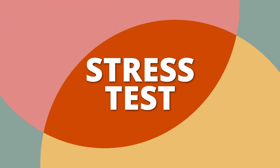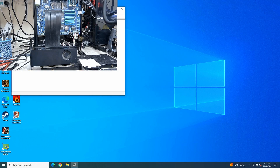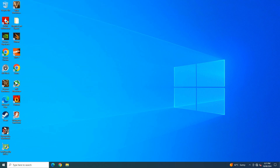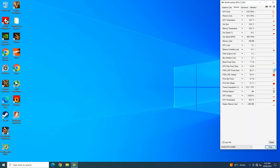I loaded into Windows and waited for the drivers to install. I opened GPU-Z to check if all information was filled in, and ran FurMark and Heavens to stress the GPU and check if it would be stable. This repair shows how challenging it can be to troubleshoot a GPU when you don't have the schematics or board view available — it's very easy to overlook components even if you are a seasoned repair technician.